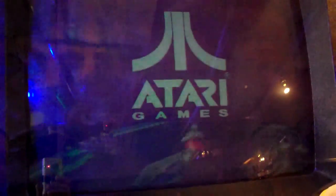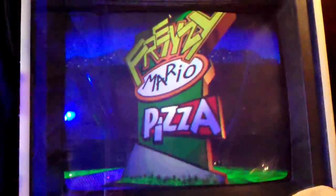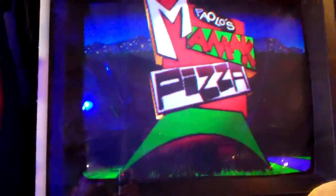Let's see if it turns on. It's pretty cold down here right now. I didn't hear the monitor. Oh, there it came on. So as you can see, the monitor actually looks pretty good. What will happen is the B+ voltage will just either go up or low or something, and it'll shut down after a few minutes of being on.